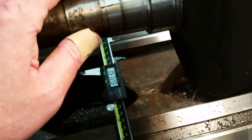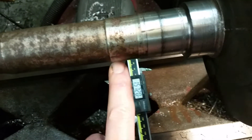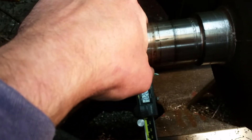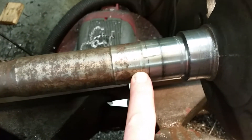I don't have four thousandths press on my collar, that's for sure. So I'm going to have to make some decisions here. I thought about putting another locking collar right here but I think that's a crutch. You could get a locking-type collar and lock it there, but locking collars generally don't hold without a press fit anyway.